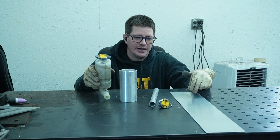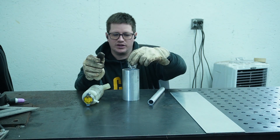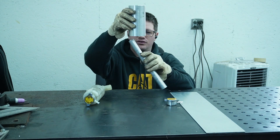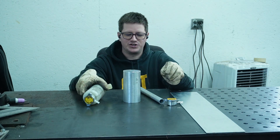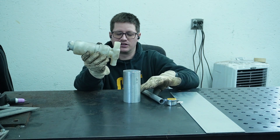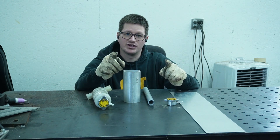I'll probably have to cut the outside by hand since I don't have a three-inch ID hole saw. I'll cut caps to cap this, drill one-inch holes — one cap goes on top, one piece goes on the bottom. It'll be a short, probably one-and-a-half-inch chunk going vertical to a five-inch piece going horizontal. At that point I have a bead roller — there's a little taper on these ends to clamp the hose — I can run this through the bead roller and flare the end so the hose will stay on. Let's get going.